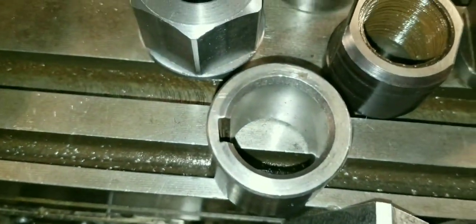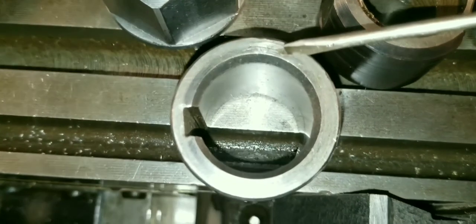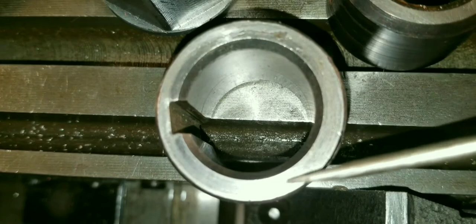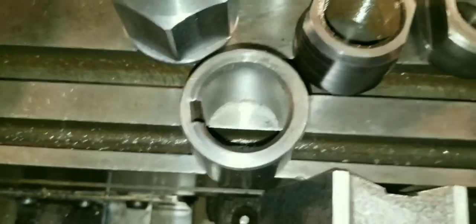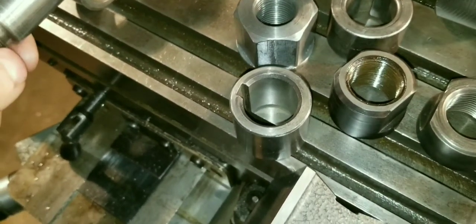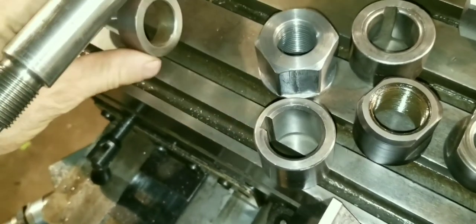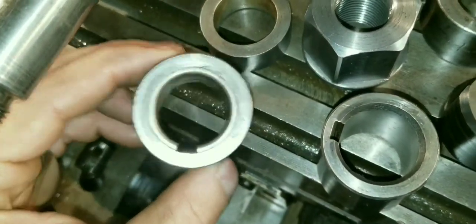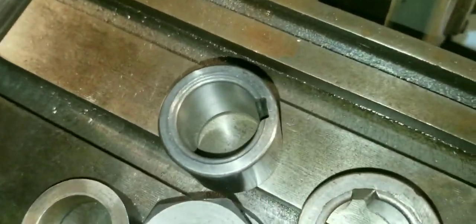There you can see. Right here you'll see a gouge, and just the overall appearance of the whole face doesn't look good. So I've got to individually go through and hone them, or probably put them on a surface plate with a piece of sandpaper. Maybe even see if I can find somebody to surface grind them for me — that would be the best thing to do. Surface grind them parallel. This one here is actually a really good one.